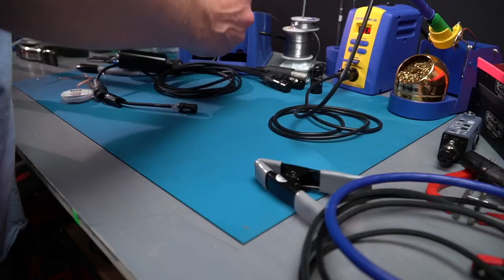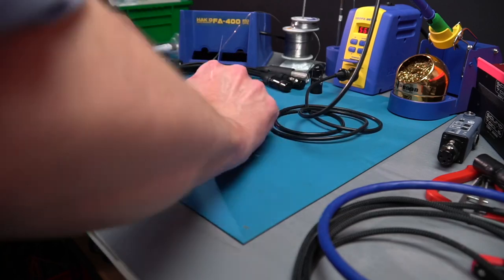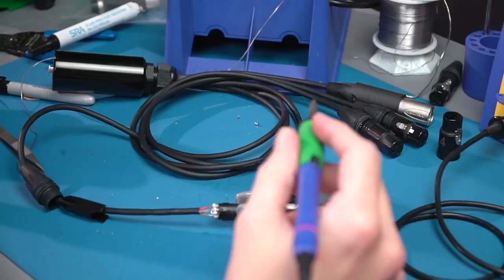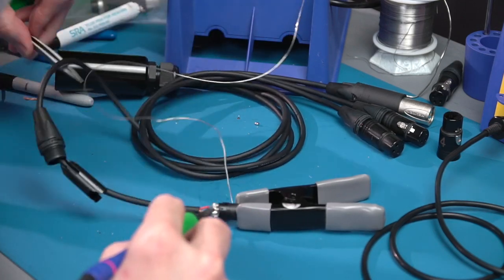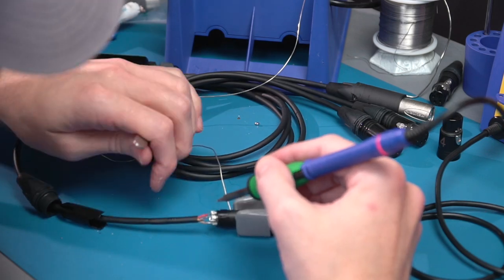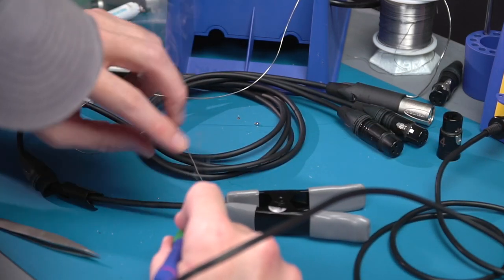It can be necessary sometimes, though, to adapt one or two of the channels on those input or output boxes at each end if you want to run bidirectional signals. Things like inputs from an artist on stage who also needs a monitor return, or maybe on-air talent who needs an IFB returned alongside their lav mic inputs. I'm sure you can think of plenty of examples specific to what you do.